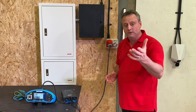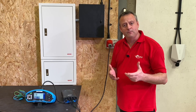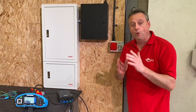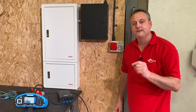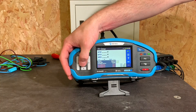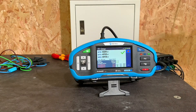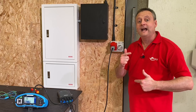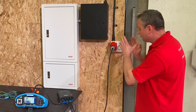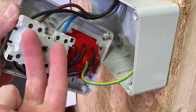Now we're going to simulate a fault — I'll change some cables around in the back and see if it picks it up on the three phase rotation. We repeat the process at the same socket outlet, take our plug, turn it on, and press the run button. The result now shows three, two, one — so we haven't got correct phase sequencing for a clockwise rotation; we actually have anti-clockwise rotation, which means the motor would run the opposite way. It's really important to investigate this — the first place to look is within the actual socket itself before taking the distribution board cover off.